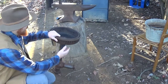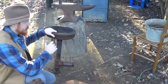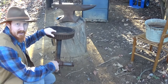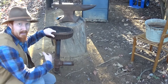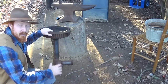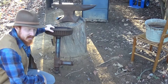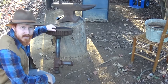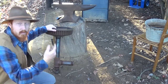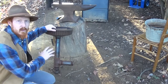I went out to the scrapyard, asked them if they had a brake drum, and they took me to an area where they had a pile with hundreds of brake drums. It really wasn't that expensive — less than $20. The whole thing, as you see it, was probably right around $50 or less. A lot of guys will use galvanized pipe fittings, but I chose to use black iron pipe fittings because galvanized material, when it's around high heat, can put off some potentially harmful chemicals. I would encourage you to do your own research on that before you start doing this sort of thing.